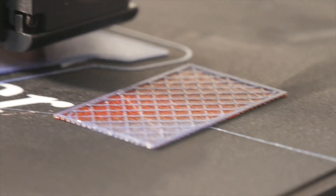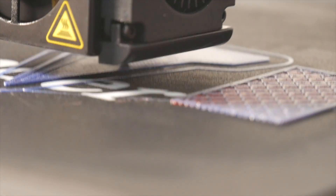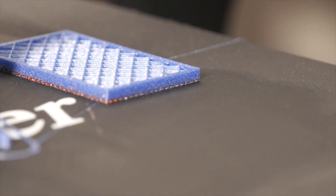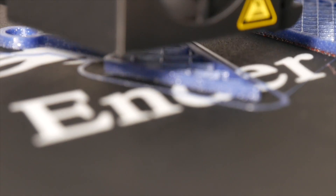For those who don't have that feature, I've been playing around with a different way of minimizing waste. It started with the Palette 2 Pro — I have the Palette 2 Pro and I've been using it with the CR-10s and it's been printing great. However, there's that purge block, and you can fine-tune it to reduce the transition distance, which is set to 13 centimeters from the get-go. You can fine-tune it down to about 9 or 10 centimeters if you tune it really well, but you still have instances of unnecessary purge when you have several layers of the same color with no transition. You still have to build that tower block to keep it level with the nozzle.